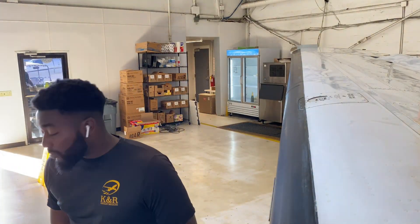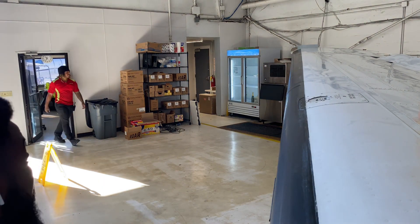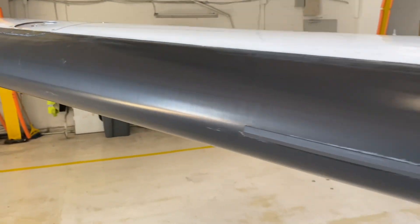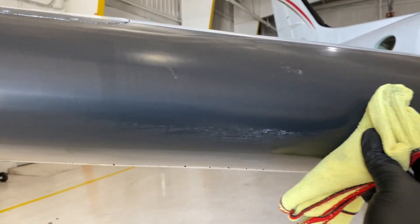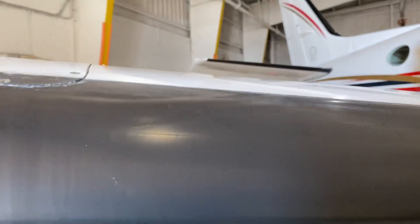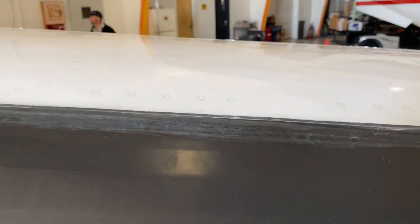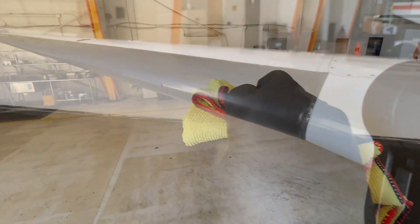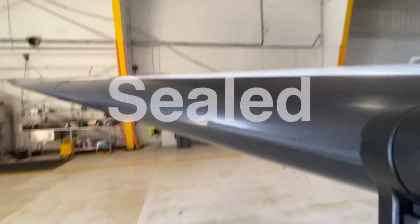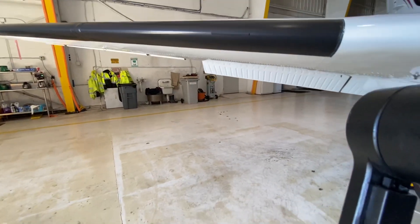If you've never used MEK, please make sure you are wearing gloves. This stuff is very nasty. All you want to do is take a little bit and put it on the rag. You'll see the leftover boot dressing right there and you just want to wipe that right off. You can do this for the entire boot — it just takes it right off. Do not try to just use MEK to strip the boots without prepping them — it will not work. This is what the boots look like when they have been completely stripped and are ready to be sealed: top and bottom completely dull, no old boot dressing left on them.